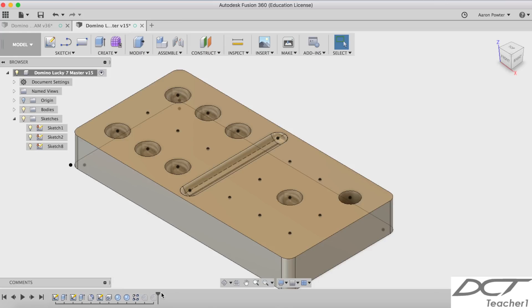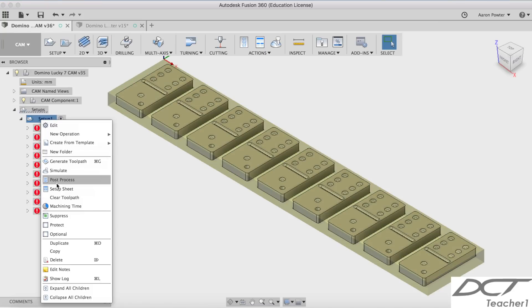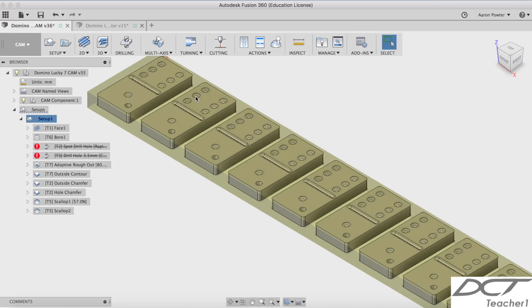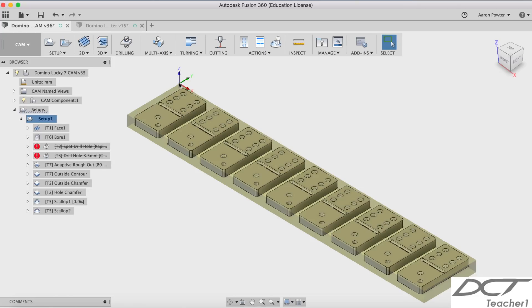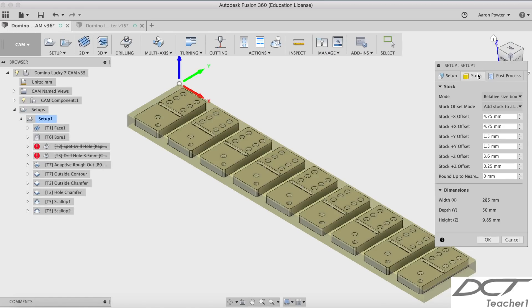These were two chamfers I put top and bottom, but I've decided not to go with those in CAM and instead do a tool path using a chamfer offset. I did a rectangular array in-line, which allowed me to put these in a dual vice setup. Once I generated the tool path, I set my G54 work offset to the top left corner. With that setup figured out, I could go to my aluminium merchant, tell them what size stock I needed, they'd cut it to size, and I could put it straight into my dual vice setup and machine it.